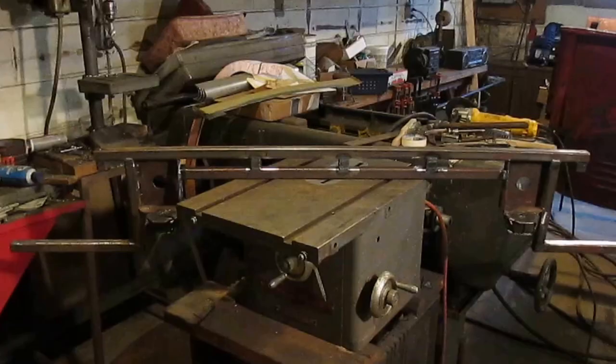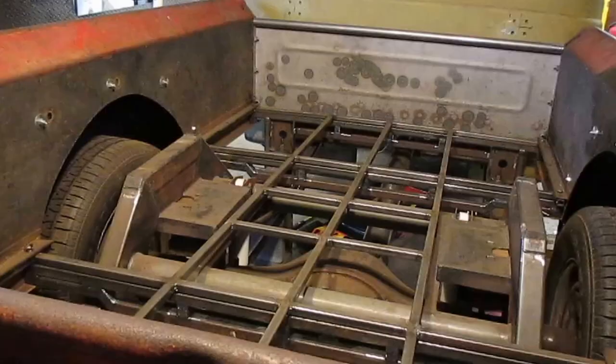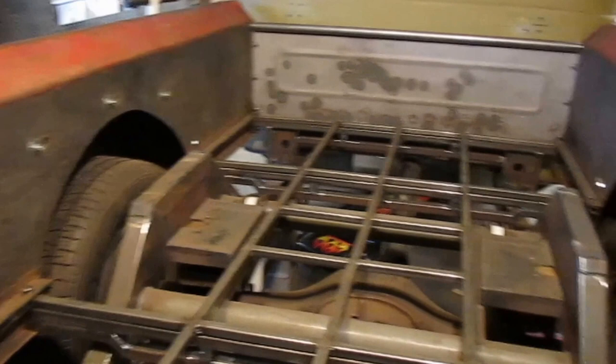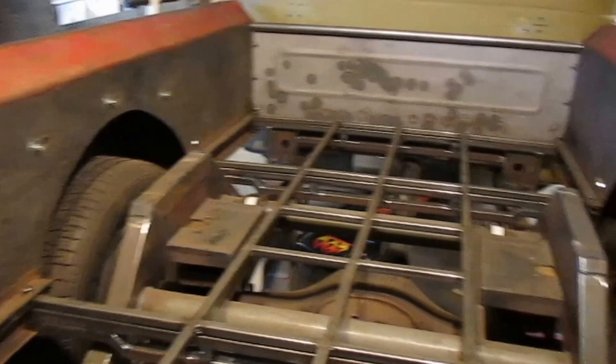There's my last bed support — I just have to flip it over, put a few drain holes in there, and put it back in. I still need to make some channels up over the wheels on the bed sides and connect those two channels that are down at the bottom, because the bed is mounted in the front and the back. But I can already walk around on this and it feels pretty stiff already, which is pretty surprising. I think I'm gonna leave it here and come back on the next one to finish off the front end.